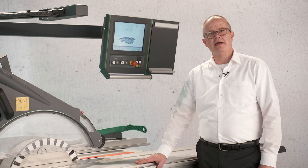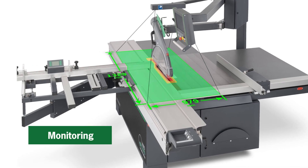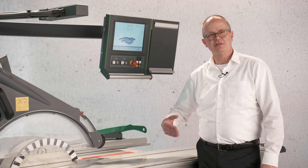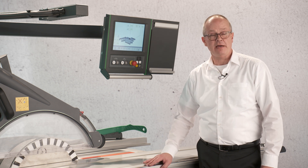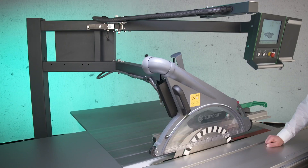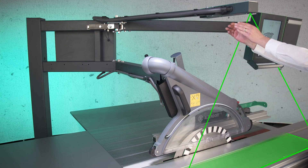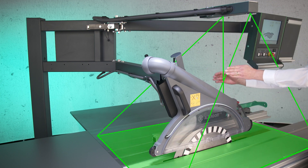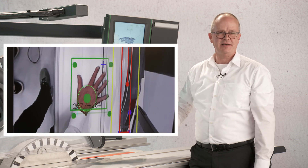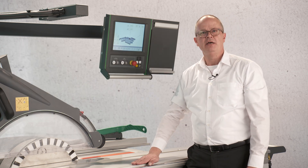The Handguard is made out of two proof technologies. One of these technologies is how we look at the surface of the working area and how we detect a hand. This is done mainly by the AI software but also by two cameras. We have these cameras over the saw blade — one camera in the front looking like a cone on the sliding table, and one camera on the back side looking at the machine table. Both together make a security area where we can detect a hand and analyze the difference between the hand position and the saw blade.